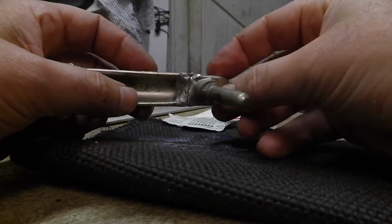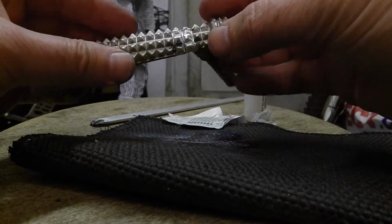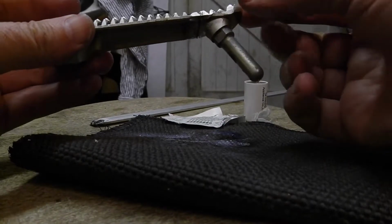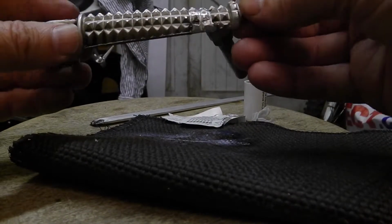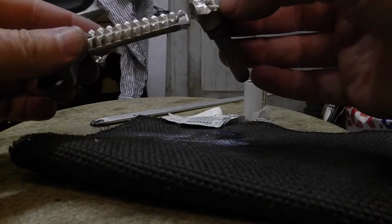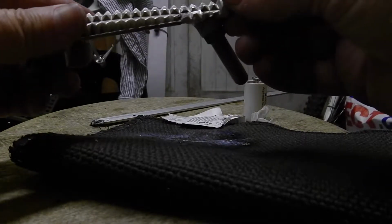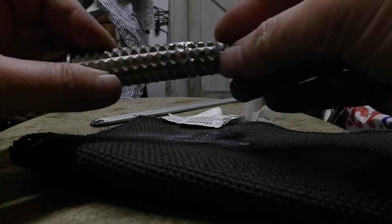So I probably should clean this up better. And you can see I was quite pleased with this when it went yesterday. It was looking pretty good. But this stays together. I can push that, this stays together. So with a fairly simple bit of wire tying the two together, I can start that weld. So that's what I'm going to do. Because if I clean that up any more, they won't engage properly, and that won't stay, and I'm going to end up tacking and doing this little bit and that little bit forever again. So if it doesn't work, it doesn't work, but that's what I'm doing.